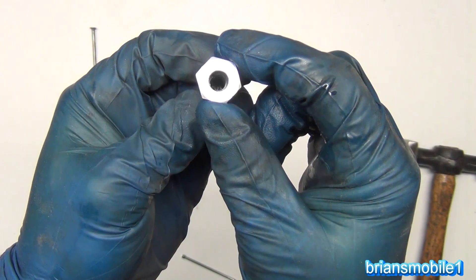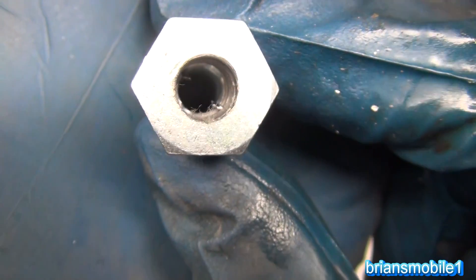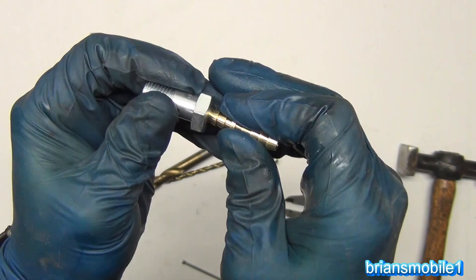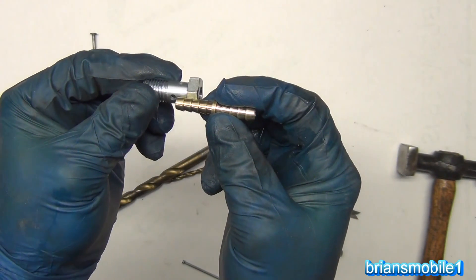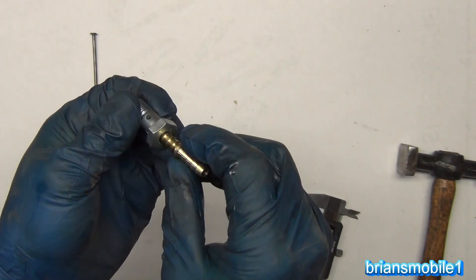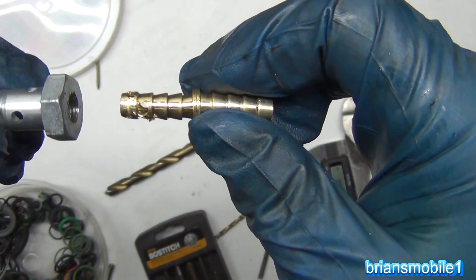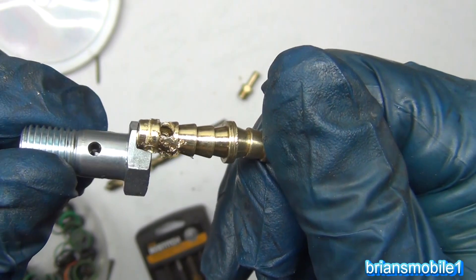It's actually surprisingly centered, but we still have a little ways to go — because when I look at it this way, you can see those little barbs. I have to clean those off; those are not allowed. If I were to take this and run it the way that it is, I would knock those through and they'd just be hanging out in there — that would be so bad. So we're gonna have to clean that up. I think I'm gonna rock this just because it's so big and it won't get lost in the toolbox, but if I go too deep I could create some problems too. Let's knock those barbs out and see where we're at. I thought that bit would be fine for the barbs, but you can see they just pass right through. That'd be a problem. This should be terrifying — when I drilled it while everything was smashed together like that, not only did it get crooked, but look at all the stuff that was hanging out there — that could have ended up in the high-pressure pump. Is it really worth it to make one of these? More and more I'm saying no.